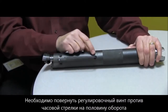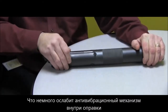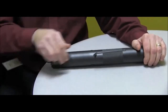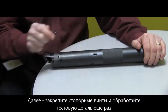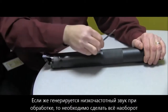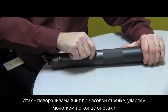When the bar makes a high-pitched squeal, you'll want to turn the adjustment screw counterclockwise — this loosens the internal mechanism. Start with a half to a quarter turn out, then tap the bar, lock down the screws, and make another test pass. If it's a low-pitched squeal, do the exact opposite: turn the adjustment screw clockwise to tighten the mechanism.